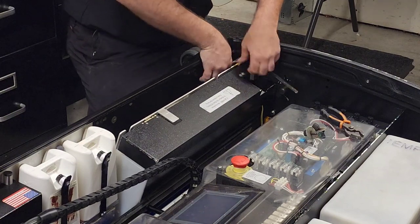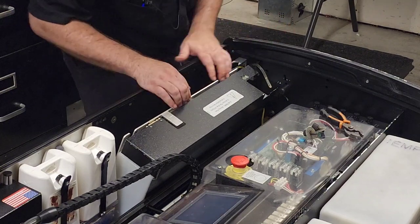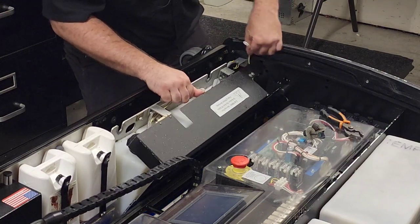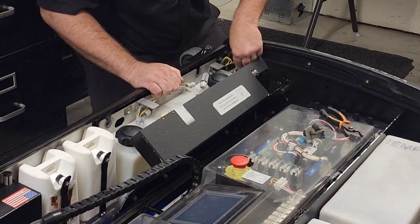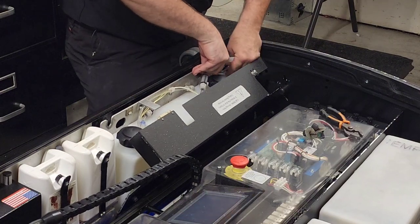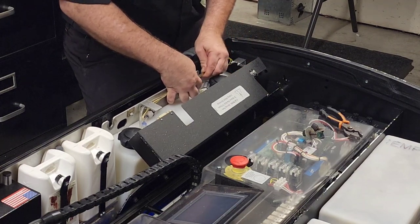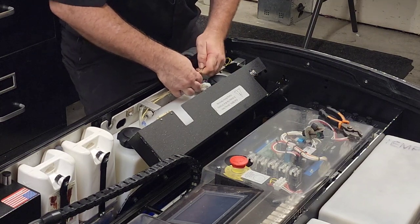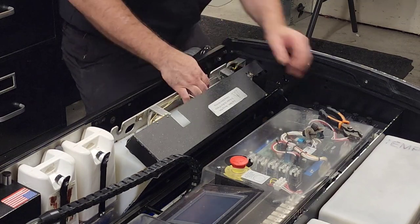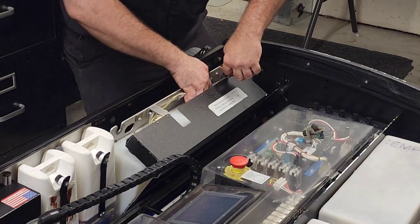So we're seated, but still pitched forward. Let's bring our tank light micro switch connection back together. Feed the cleaner concentrate line under the micro switch for the tank lights and bring that union back together. Can't tell if the tubing has seated because my hands are slimy with cleaner concentrate. Here, grab a set of pliers and we'll hold the tubing with pliers. There we go.